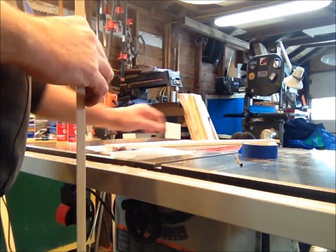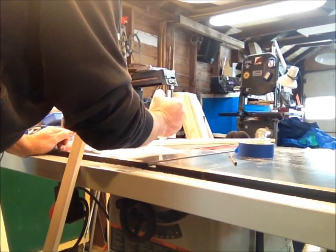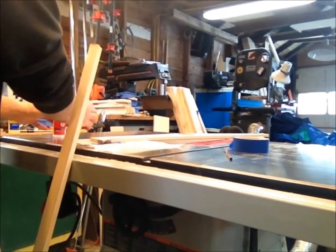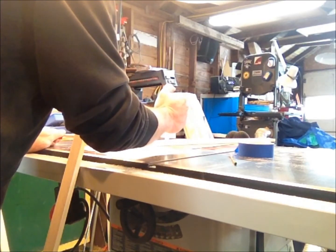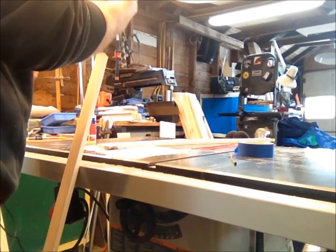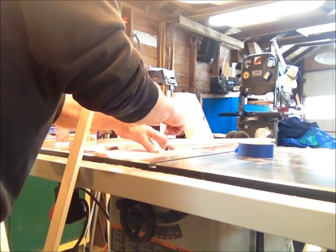What I'm going to do, I'm going to take some blue tape. Already got a piece on there. I'm going to mix up a little bit of epoxy. You've seen me use this before if you touch my channel at all. And I mean a little bit. Don't need much for this fix. A little hardener. A little bit of resin. 50-50. 1-to-1. Half resin, half hardener. And we're going to mix these two together. Now this is 5-minute epoxy, so it's not going to take long for it to harden up.